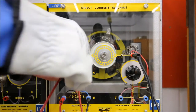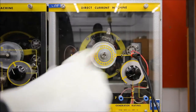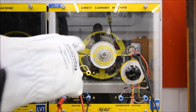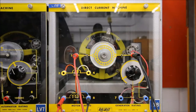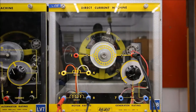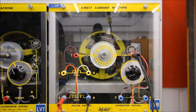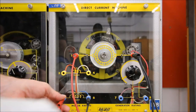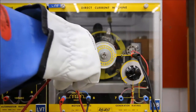That leaves us with C. C would be the feed to just the armature. I'm going to feed the shunt winding but take away the feed to the armature. When I take away the feed to the armature, it comes to a stop as well. That's no fun whatsoever — everything just seems to stop with no sparks or anything like that.